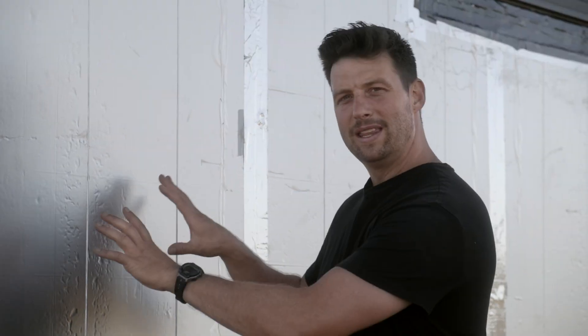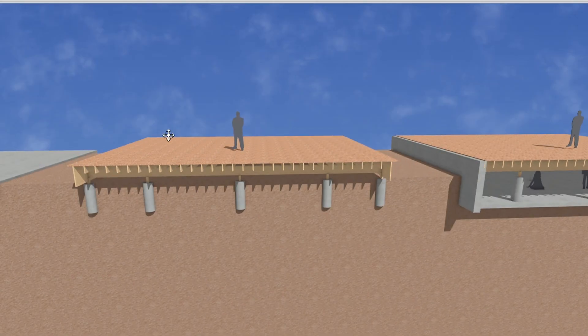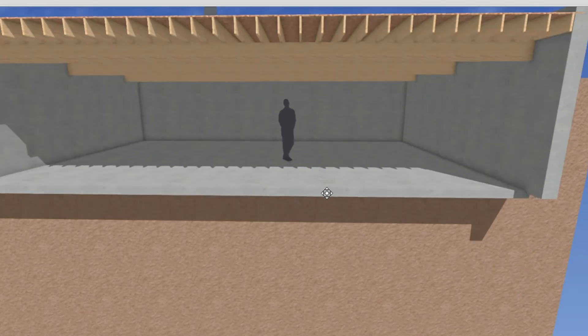As we go north, it's not only easier to justify, it's almost always required if you're building a high-performance home. You want to insulate all of the parts of your house that are touching unconditioned spaces. For your slab, make sure the cold earth is not sucking all the heat out. For a stem wall and crawl space, make sure your stem walls are insulated so heat isn't getting pulled out through the stem wall into the soil beyond. For a basement, the same thing — you don't want it cold, and if you don't do your waterproofing and insulation right on the outside, you can get water infiltration, dampness, or condensation causing moisture problems. Insulation and high performance go hand in hand, especially when talking about foundations.